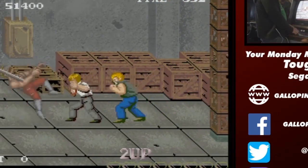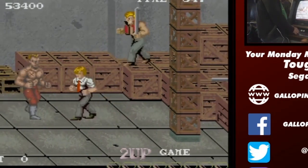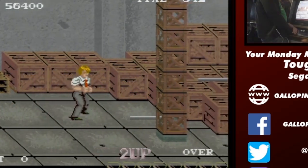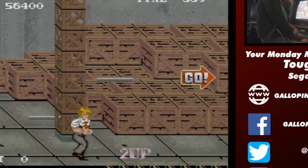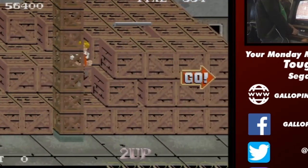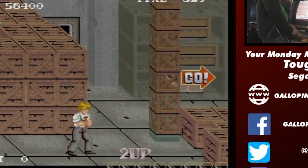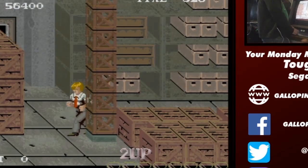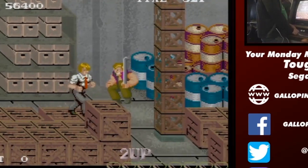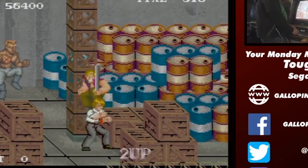So Doug Fox came out, Master Tech Doug Fox, the one and only Doug Fox, who helps us fix so many games. And it turns out that there was a service harness connected that was, for some reason, pulling a huge draw on the 12 volt right to the audio amp, and we took that off, and it was totally fine. Maximum Coolio, absolutely. Doug Fox does rock. We could not do what we do without him.